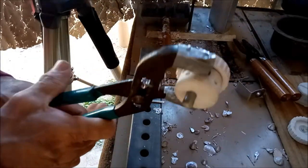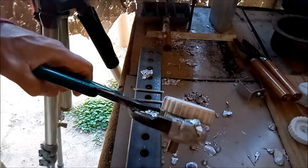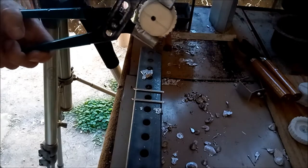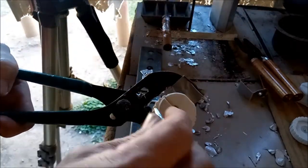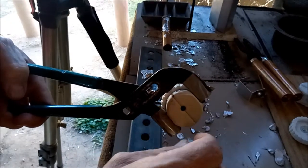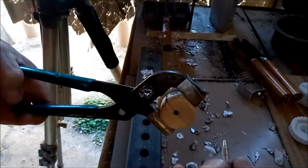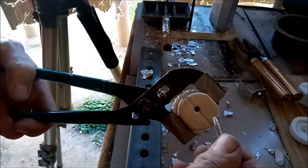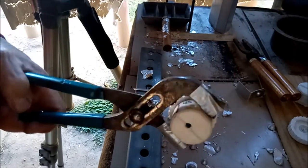This is the 45, the newest, the latest 45. It's a flat-sided. I wanted to show you how I've been heating them on the heat plate. I didn't want to place them directly on the heat plate because in the past I've noticed when I do that, the surfaces that touch the heat plate start to crack, like they develop those same striations that I showed you on the inside of the mold cavities when they're subjected to intense heat.